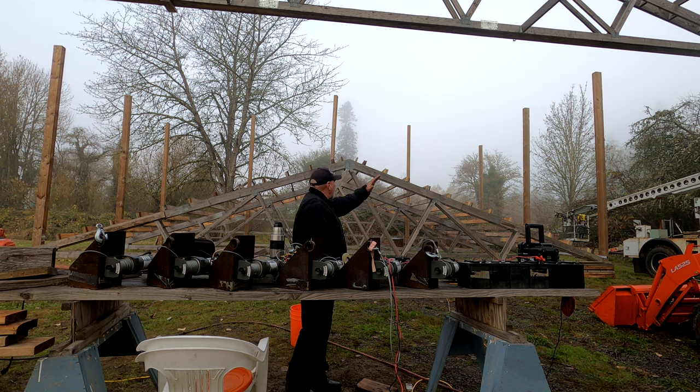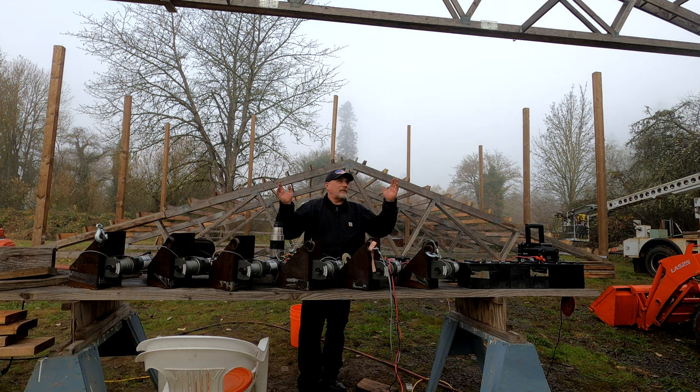But I got to looking, and we've got 9 posts there that are going to be holding this section of the building up. Well, 6 of the 9 are twisted. This is something that I've heard commonly happens. Even after people get buildings up, they twist. But you've got to deal with it. We didn't deal with it right when we put the first section up. I got lucky on the center section. None of them were twisted. Wow, that was nice. Anyway, the first section that Lou and Jim and I put up, which is behind you, had some seriously twisted posts, and we didn't deal with it until we were up in there. I don't know why, but it was really hard dealing with it, with the section of the building in the way and around the posts.